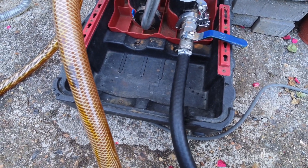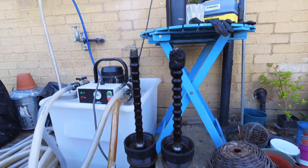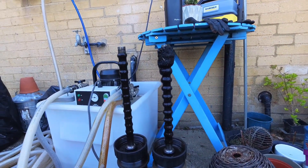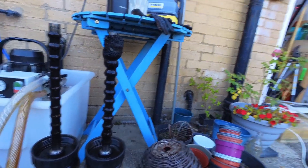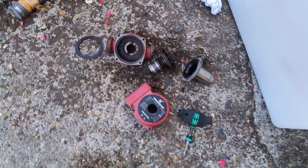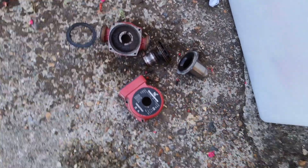I've just finished the dump of the whole system and that's what's caught on the way out. That's normally what I get on a standard power flush, but that's what it's caught on the way out after dumping the whole system and after one round of circulating everything. Let's get this cleaned off and then I can put everything back together. So just taking the pump apart and yeah, it's completely battered - it's had it. Let's go upstairs and fit the new pump.